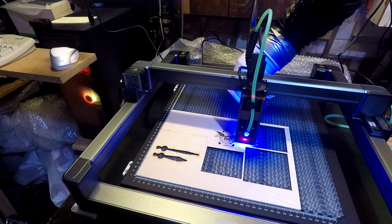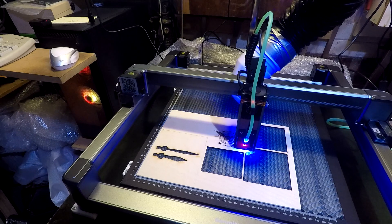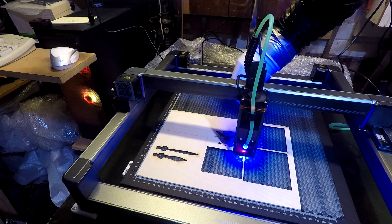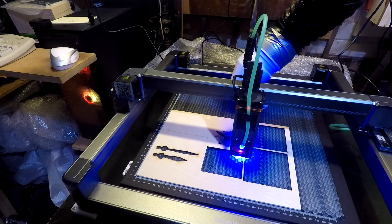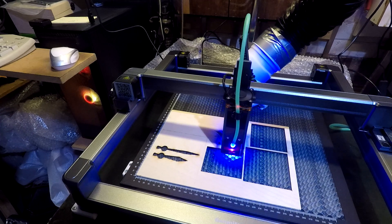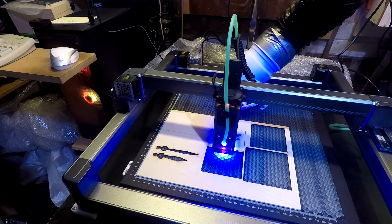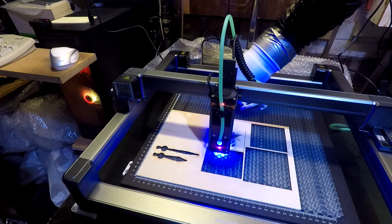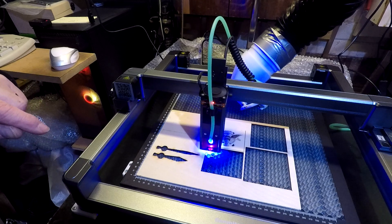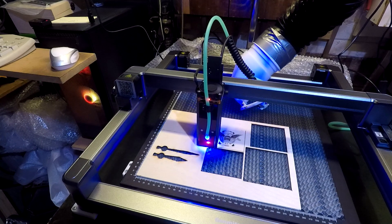That's the cut done. With the XTool on 3mm good ply at 200mm per minute, it might leave feathering attached to the edges, so I knocked it down to 180mm and it cuts clean. I could run this Jimitsu at 210, maybe 220mm per minute and it would still cut through. The laser unit is exceptionally good.